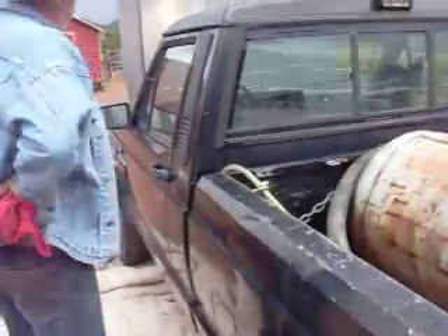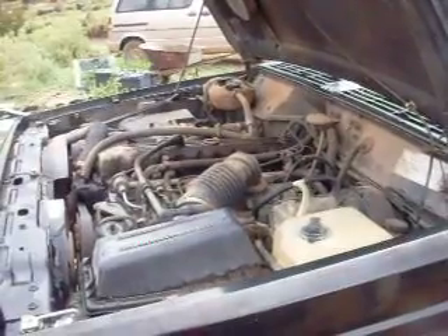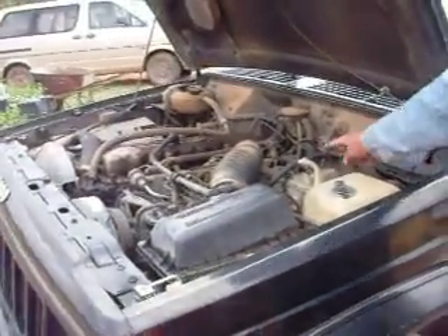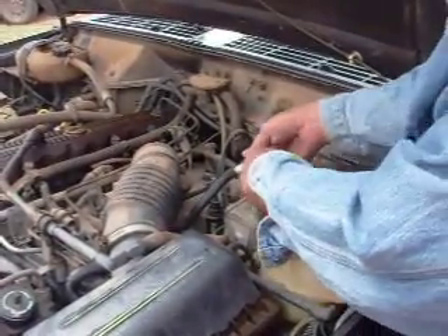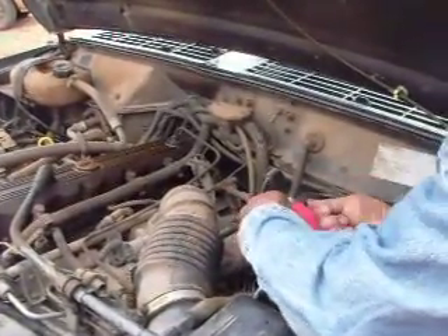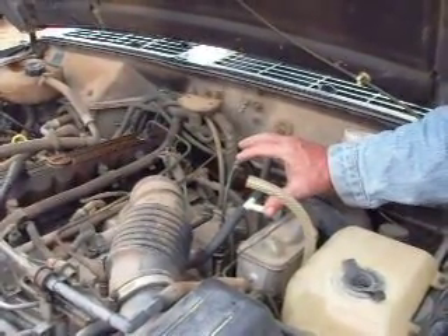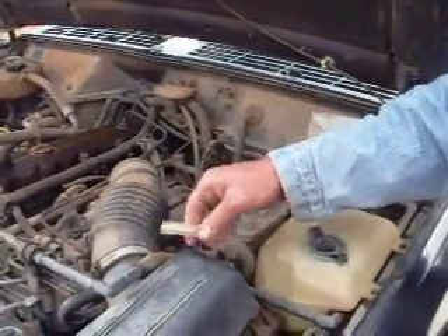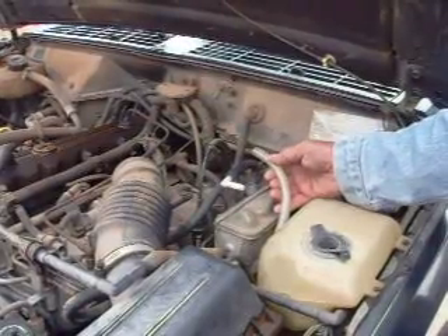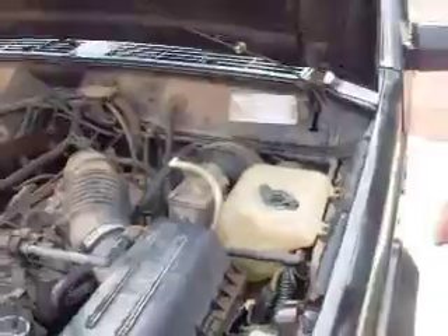So let's make this truck suck — let's go to the front to the engine. This is the vacuum line for the vacuum boost brakes, so I just use a regular vacuum tee that you buy at a parts store. If the engine speeds up, it's got a vacuum leak. It's just lying right here — now it's idling fine. This hose goes down underneath and follows the routing along the frame to stay up out of the way, and it comes up in the bed of the truck. That's our vacuum hookup up here.